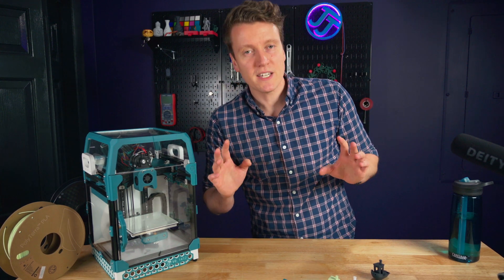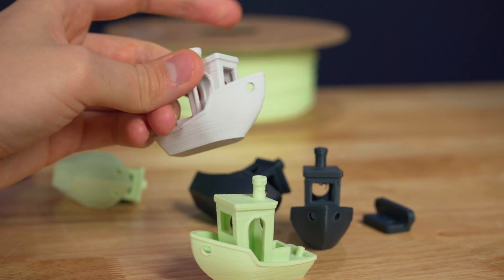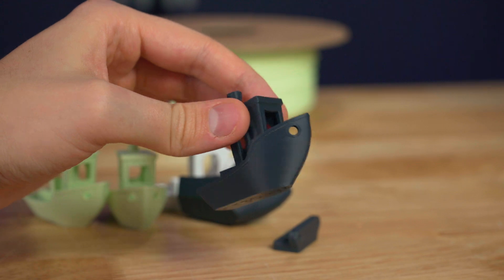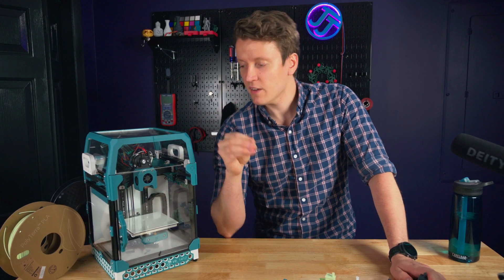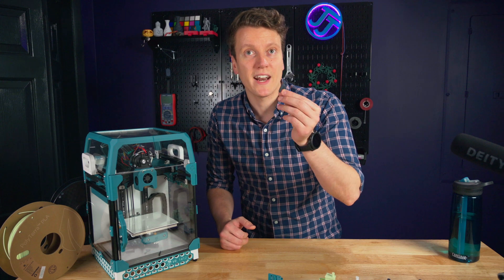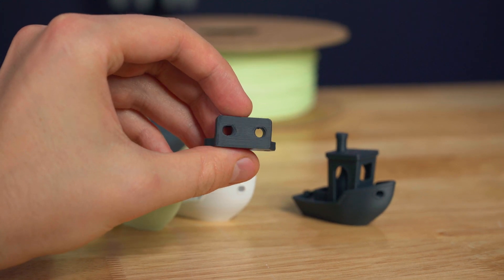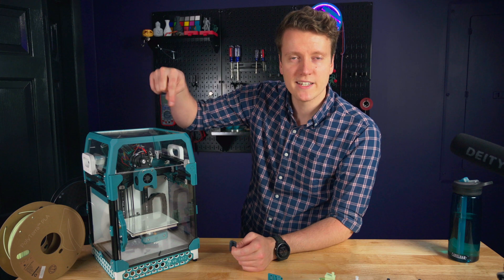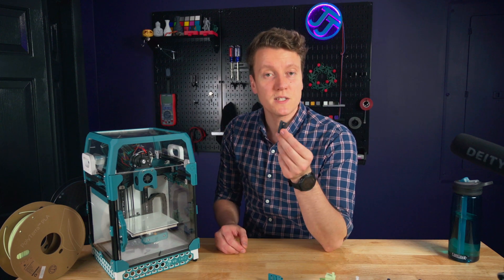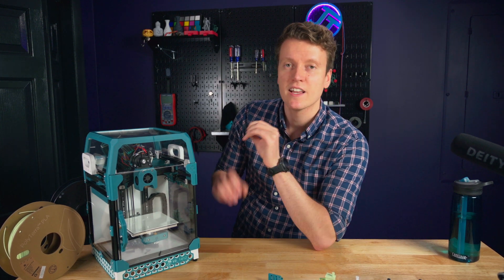There are so many different methods for cooling, but I'm so glad that now the extruder issues are fixed. The artifacting that was showing up on prints is now gone. I'm able to print way faster — before it would always start skipping and couldn't really push filament hard enough. This little print is a great example: it's an accelerometer mount that goes straight onto the hotend to do resonance tests so Klipper can balance out frequency and vibrations. Something small like this took about eight minutes to print — it's amazing to prototype little things so quickly.